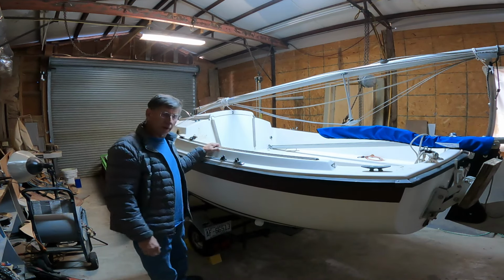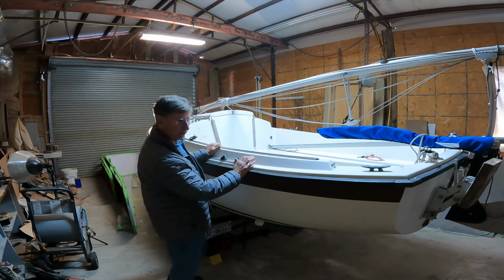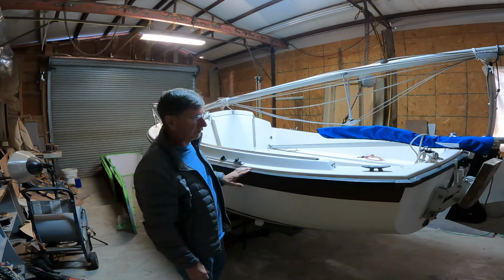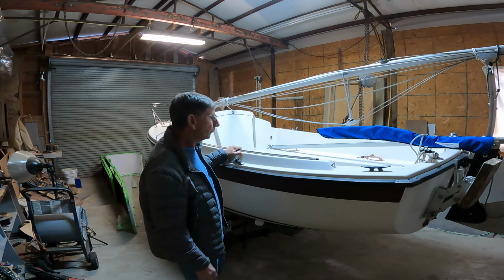The rainwater has not done any damage on the inside yet, so it hasn't been leaking long. I think that this joint has been repaired at least once before. Just as a matter of course, I almost always reseal the hull deck joint when I get a boat in anyway, just to eliminate that potential problem.